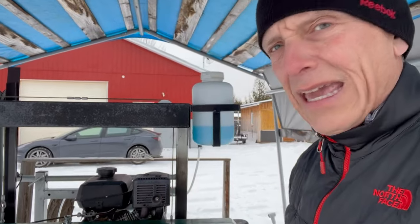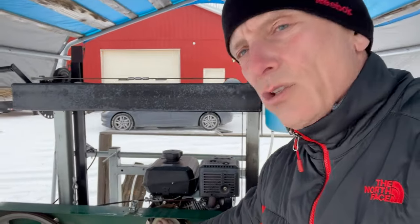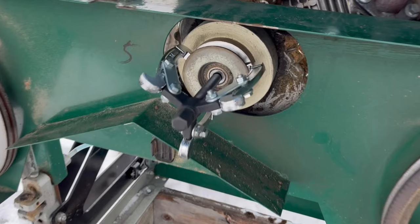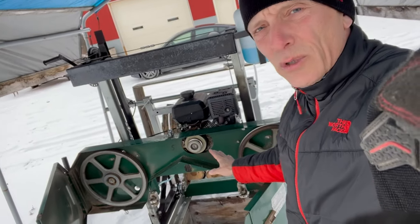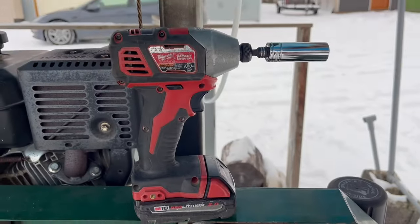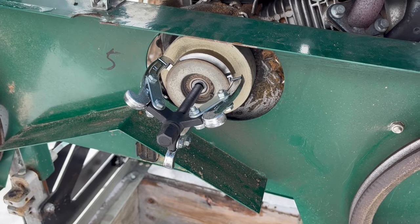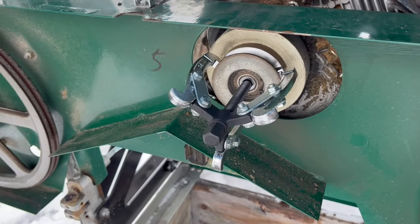Based on the description I gave to the technical support team at Woodland Mills, they believe I've got an issue with my clutch. The drive belt is off — let's see if you can see that the shaft screw, the retaining screw, is out. I purchased a little puller so I'm going to try to get this set up and see if I can get that clutch removed. Fingers crossed this works. Got it on there secure, got the drill driver ready to go. I'm going to put you down, have a go, and show you the result.